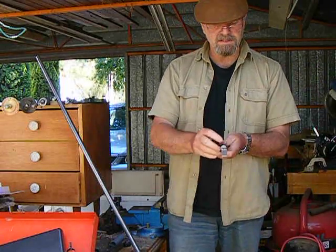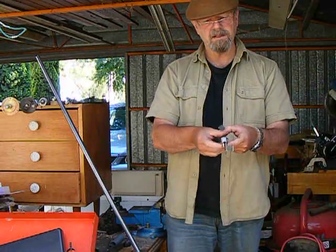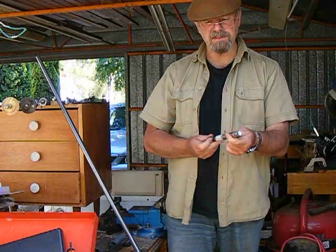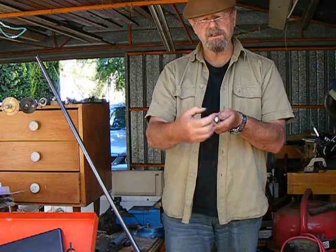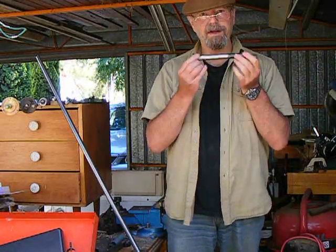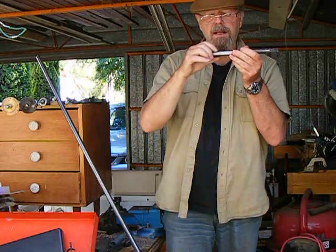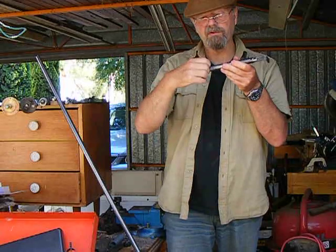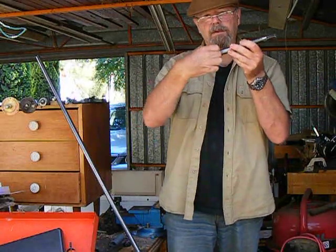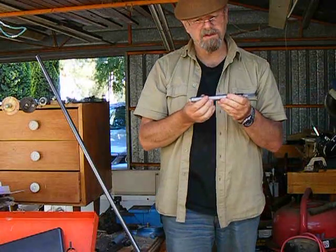The trick is you've got standard merchant bar, 13x3mm flat mild steel, with the edges ground off. You fit the two bits in there — I'll show you as we go along. You've got to get a nice fit for the locking tang to go through; you don't want it too sloppy because the tighter the fit, the less distortion you get when the thing's being pulled really hard. There's a lot of force in this. This tool was designed so that if it only catches on one dog — if the holes in the sleeve are drilled out of level — that's 700 kilograms of capacity before it shears off, which has proven to be more than adequate.